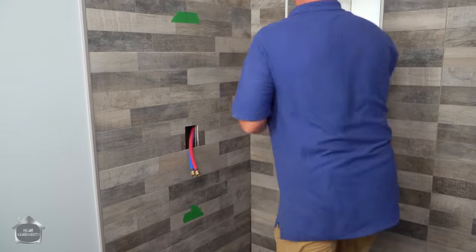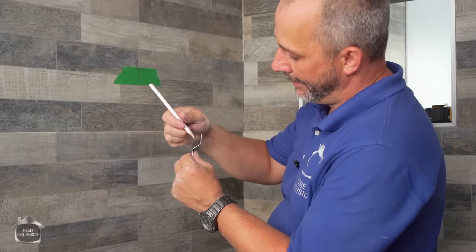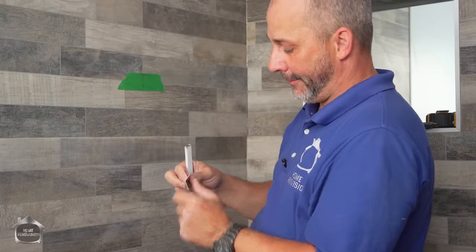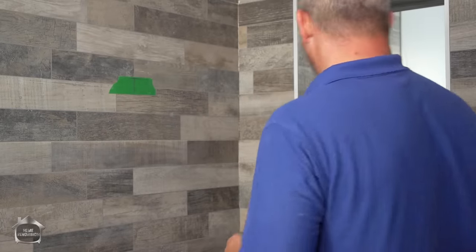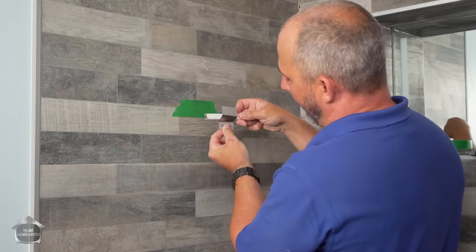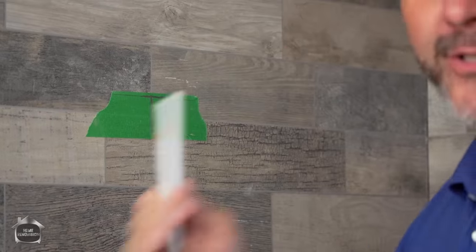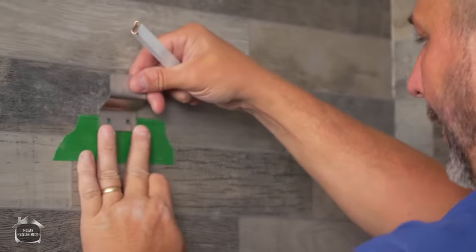All right, loving it. The reason you want that perfect is there's only this little bit of area here to work with. This slope is actually what pulls the machine under gravity towards the wall. If you have them set too far apart, it'll engage with one piece and not the other, and the machine will end up wobbling around, and that's not desirable. So now we take our clips, because the back of that machine that we were measuring from actually sits right near the bottom, all right? So your overall dimension of where we roughed it in is gonna be plus or minus 1/2 inch, so don't be too hard on yourself here. Let's just work with the numbers that we got.